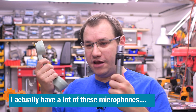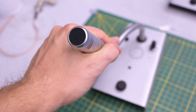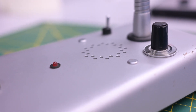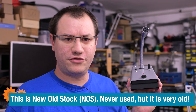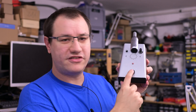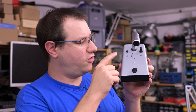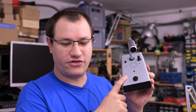Thanks to my massive hoarding problem I have microphones and I have things like this. I found this thing here which is a microphone and a speaker in one case, used for taxi communication in the 70s or 80s — it says made in West Germany so it's quite old. For an audio transmission project we need a microphone, a speaker, a potentiometer to vary loudness, an on/off switch, and a push-to-talk button. I also want to make sure I only activate the sender when sending and only the receiver when receiving, to save power — otherwise both antennas would interfere and create a feedback loop.